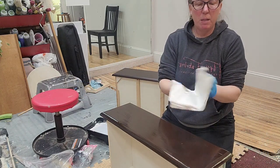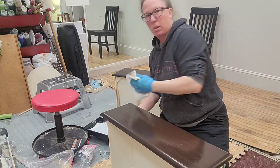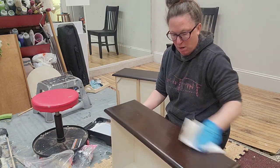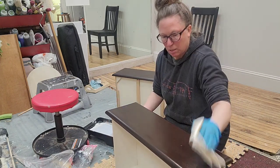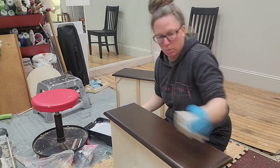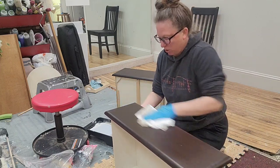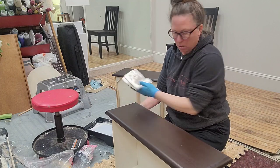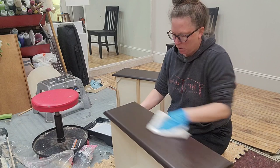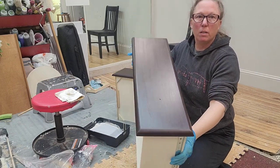After this drawer I'm going to want to get a completely different cloth because I just don't want to push my luck. These cloths aren't expensive, but you do want to throw them away — they're not reusable since they're oily. You want to lay them flat to dry. I think I've checked before and there's no combustion warning with Fusion.